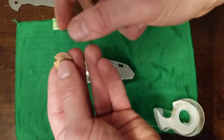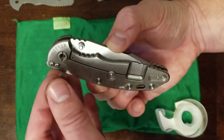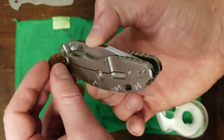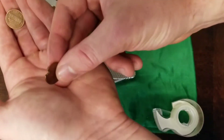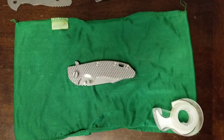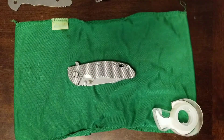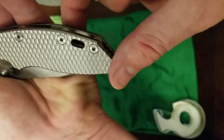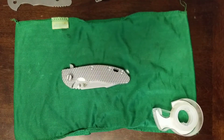If you are going to take the scale off your XM18, there are times where you'll need to lift the knife up, and those female ends come out and fly all over the place — the standoffs come out and it's a nightmare. So I'd definitely recommend putting some tape on there; it will save you a lot of trouble. If you don't have the armorer's tool, you can cut a notch in a penny, which fits the spanner side of the XM18 perfectly. Pennies are copper on the outside, and copper is softer than the steel hardware, so you'll never scratch up your hardware.